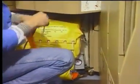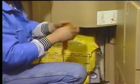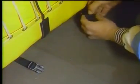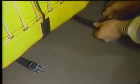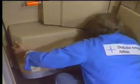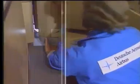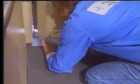Remove the lock pin assembly from the operating head of the slide raft inflation reservoir and put the lock pin assembly in the stowage pocket installed on the pack assembly soft cover. Put the pack assembly decorative cover in position. Connect the cover attach straps.